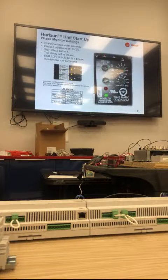Because of that electrical load, on Plymouth they were just pushing all the power there with no return line back, so they were just killing me. They would see 510, 512 volts, and one leg would drop to 460. So we put the phase monitor in to protect it. But the IMC caused too many nuisance trips.